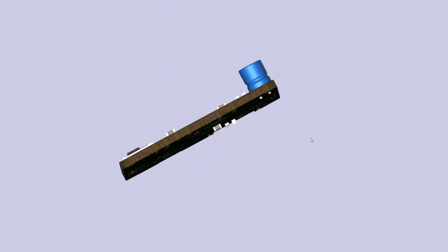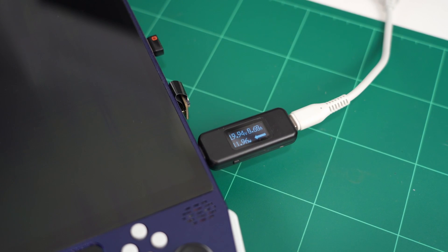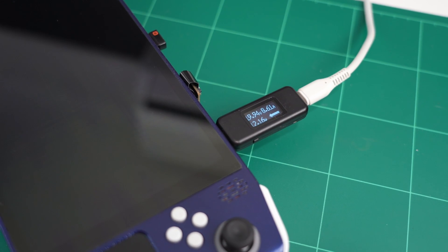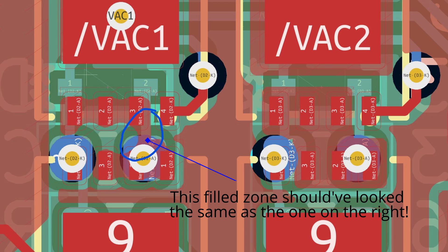The first issue is the charging speed. One of the biggest problems I had with this project was getting the BMS to charge at the correct speed over the USB-C port. I did have it working when I completed the previous video, but shortly afterwards it stopped fast charging again and dropped back to the painfully slow 15 watt charging. Despite my best efforts, I haven't been able to pinpoint a reason, although I did find a small problem with one of the filled areas on the PCB, which I've fixed on the version up on GitHub. It's not a software issue because the secondary charger port charges at the correct speed consistently, and they're both controlled by the same area in the software. Since the hardware is basically identical, I suspect the issues are simply either an assembly issue or a faulty bit of hardware.